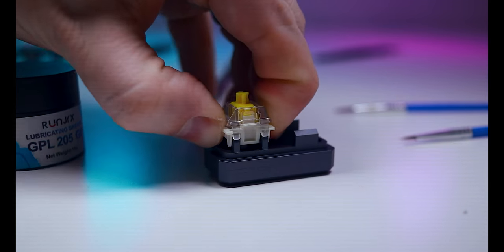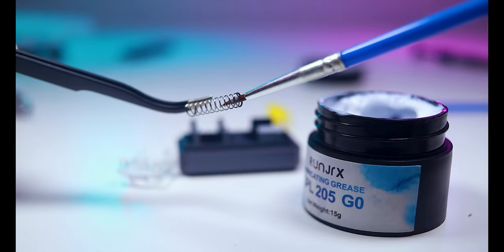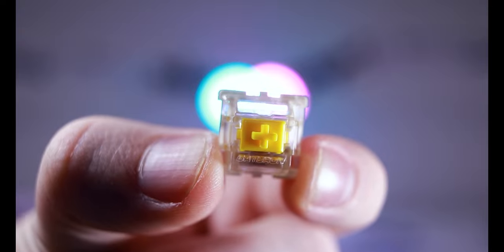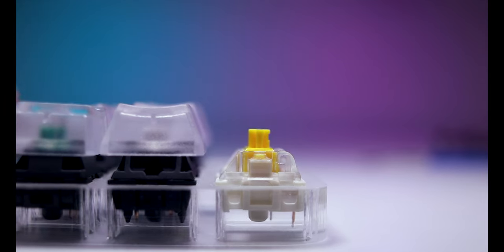The components in the toolkit make lubing switches yourself significantly easier. Generally, a very thin layer is all that's needed on the inner components and the spring — if you want to watch a detailed video on switch lube best practices, I've included a link in the description. If you decide to integrate lighting into your custom keyboard, this will also influence your choice in switches. Most modern switches include an SMD window, a slit that allows light from the PCB to make its way through the switch, and some switches even have transparent tops to diffuse light around the keycap.